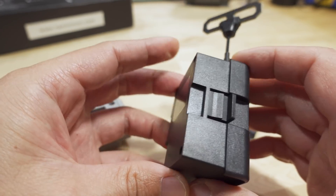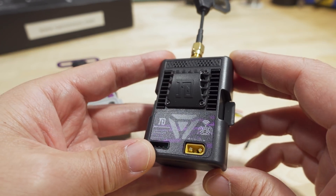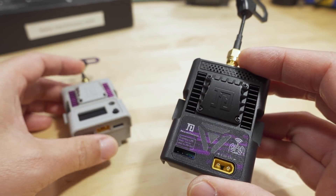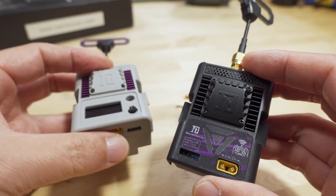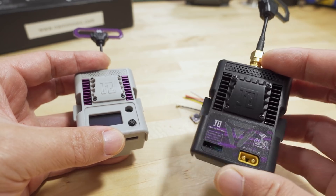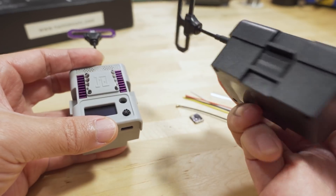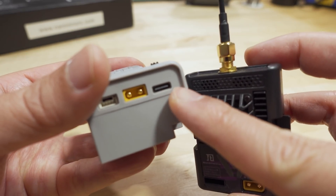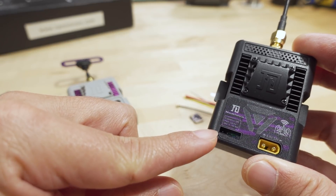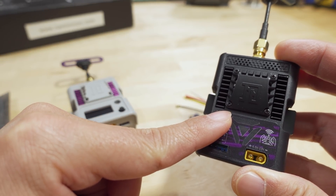You can't get the V1s anymore. They're pretty much all gone. And when they switched from the STM32 to the ESP32 chip — which is the more common chip now for ExpressLRS — they came out with this new model. All of the ways that you update changed as well. For example, there's no USB port on the V1, whereas there's one now on the V2. And to do the update via the pins on V1, I had to get inside and do something called STLink, which is kind of complicated.